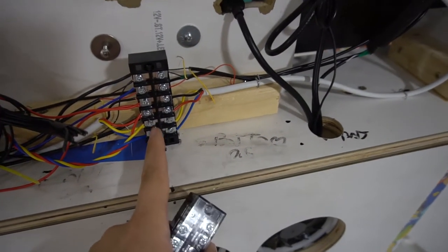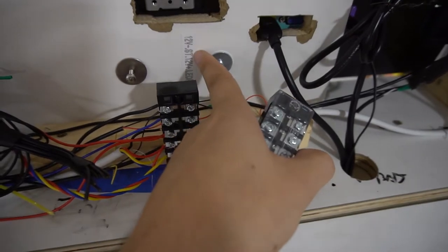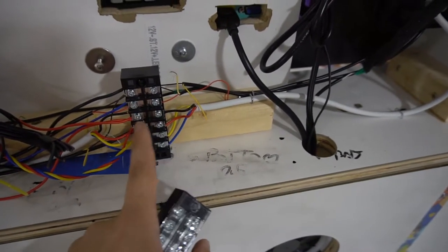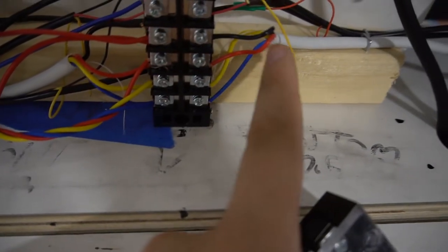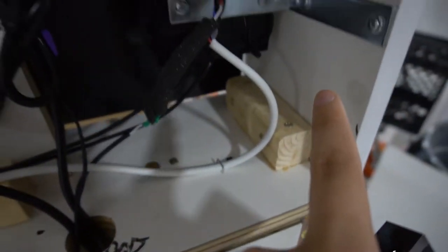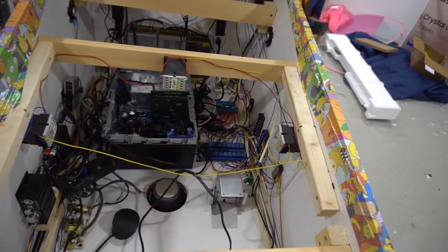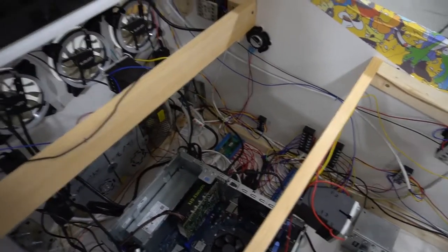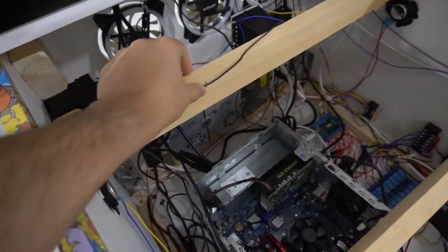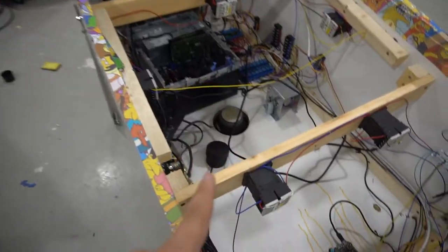This is a prime example right here — I'm using all six channels: one channel on top is 12-volt negative, next is strobe, then 12-volt positive, then RGB for my LEDs. You can even see the white wire going to my custom LED ring on the speaker RGB. To some people this might look like a disaster, but everything needs to be wired and this is the cleanest I could get. Try to keep it stapled down so these wires don't move in transit.